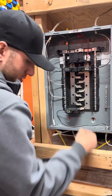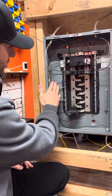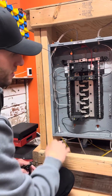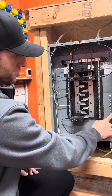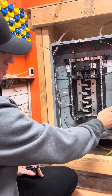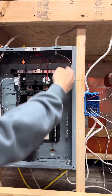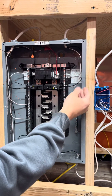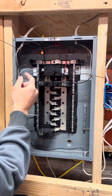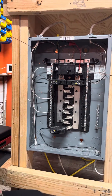It's just a more professional way of doing it. That's how you've separated them. Now these white conductors — the grounded conductors, your neutrals — are in no way bonded to this ground bar. You'll proceed by repeating the steps: bring the ground down, bring it up to this bar. You'd need to extend wires with a wire nut to bring them over to the ground bar. All your grounds get landed on the ground bar, and all your white conductors get landed on the neutral bar.